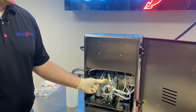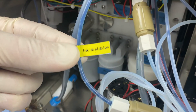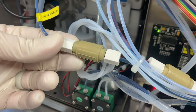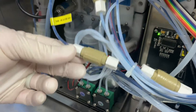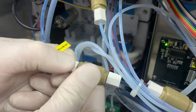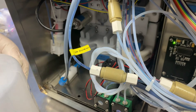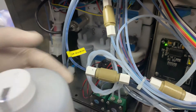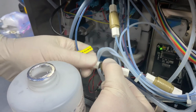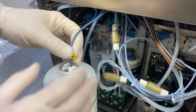Locate the drain pipe — every JetStream will have it labeled with a yellow tag that says 'Ink Drain Pipe.' Locate the inline filter that the pipe plugs into, and on the side where the tag is, disconnect the compression fitting. Once disconnected, put the pipe into your waste collector, then open the collector so you're ready to start draining.